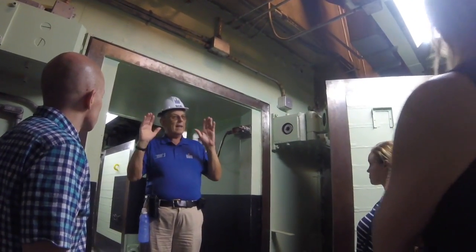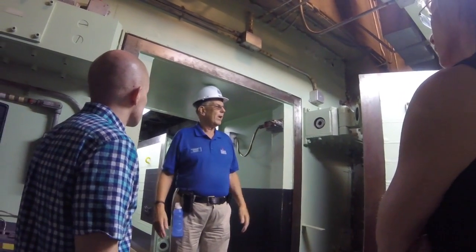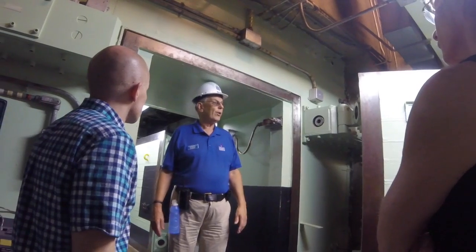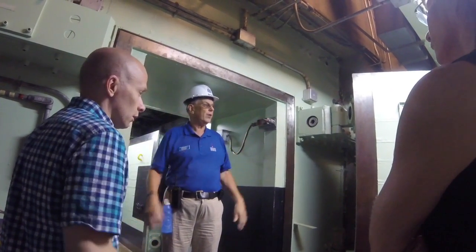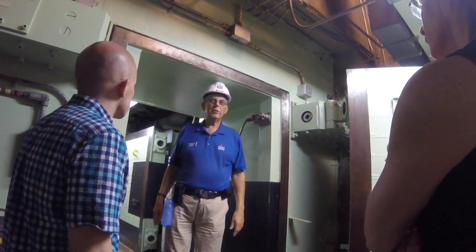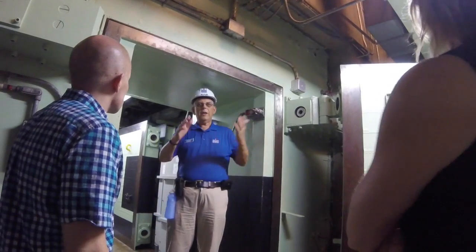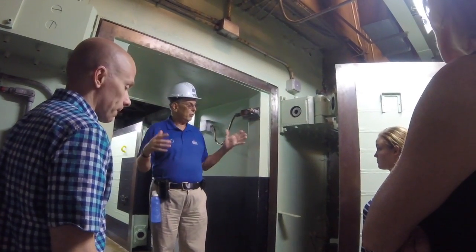If you think about it, that 5 to 7 psi of overpressure would destroy a normal stick-built home in a hurricane or tornado situation. 12 to 13 psi would take out most industrial buildings. So this was designed to withstand a very large blast wave.